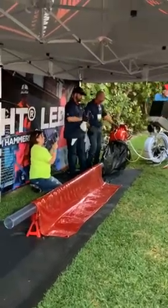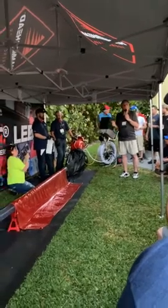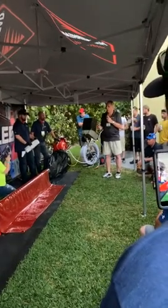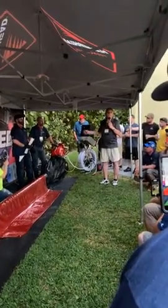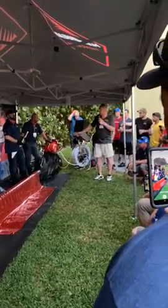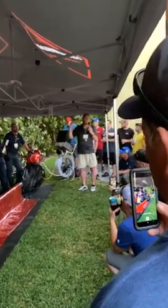That light spectrum is what gives off the waves to cure this liner. One of the problems with lining using epoxies or resins of any other sort was that once you mix that two-part epoxy, your stopwatch started — you better get it wet out in that liner and shot down the line. With the blue light system, they actually wetted this liner out last Friday, threw it in the van, it sat in the van all week at 80 to 90 degrees. It does not affect it — it's still pliable.